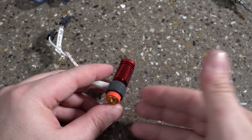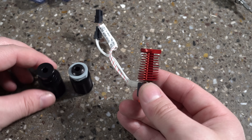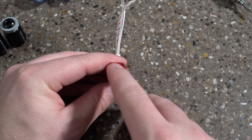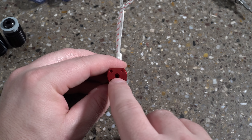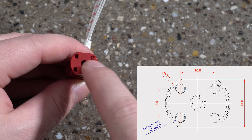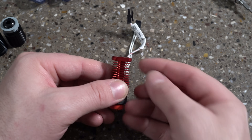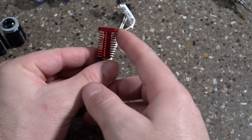The hot side is going to be the same across all Revos — whether you're running the Revo Voron, Revo Micro, or Revo 6 heatsink. There is no Bowden collet at all, so you will put a PTFE tube down and it meets directly with the top of the heat break. For screw mounting, it is a flat top using M3 screws — no M2.5 or M2. The top flange is relatively thick, giving some forgiveness on screw length to avoid damaging the thinner fins. There are flats on the front and back, and the side has a nice curve to it.